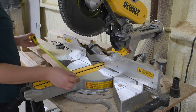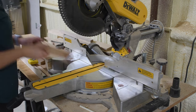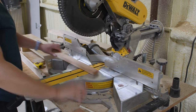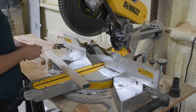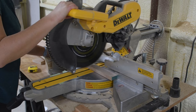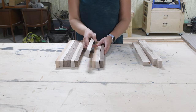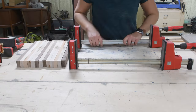Let's make this one. Determine the length you want and cut all your one-by-two pieces to that length plus about a half inch, giving you room to square off after glue-up. To find how many pieces you need for your desired width, divide that width by 0.75 — each one-by-two is three-quarters of an inch thick. For my 10-inch board I needed 13.33 pieces, so I used 13. Once cut, I played with the arrangement of walnut, maple, and cherry scraps until I found a pattern I liked.